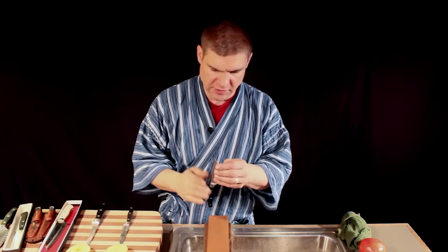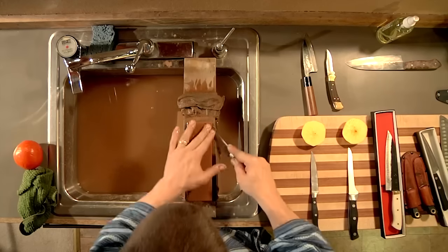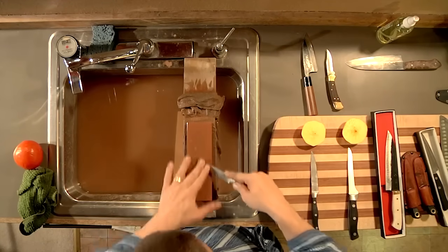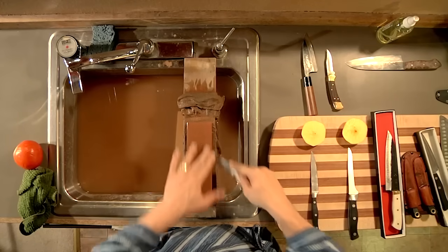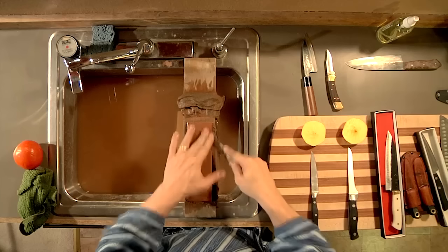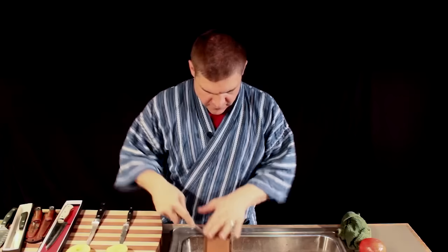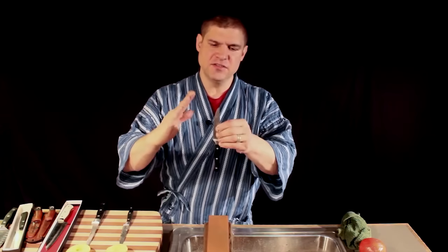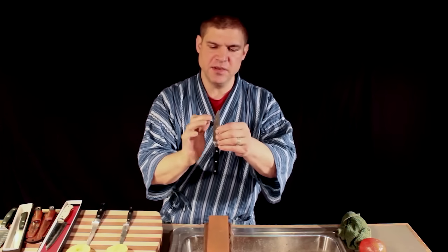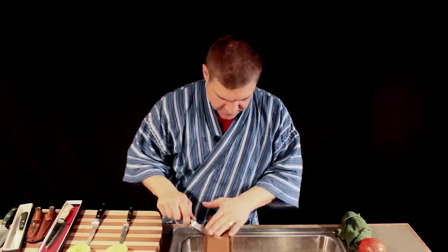But we can get it absolutely perfect. We can get it to the point where it's what we call thumbtack sharp. What I call thumbtack sharp means that when you lightly touch your thumb to that point, the point of that knife will pick up the skin of your thumb pad, of your thumbprint, like a thumbtack would, like a tack that you'd use to put a poster on a wall. You'll notice also that it doesn't look angular. I've been blending it all in and grinding basically from here all the way up to the tip so that it looks aesthetically pleasing.